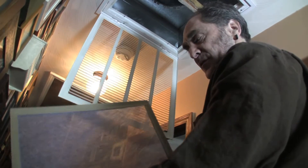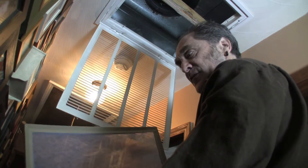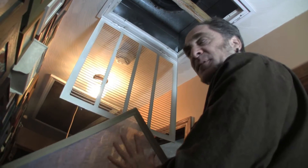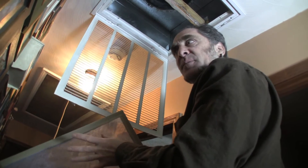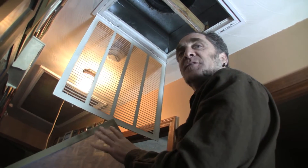Here's the filter. The bottom side would be very dirty if it were an old filter, but this one's barely been used — it was probably just changed. These are a great type of filter and very cheap, costing about 75 cents to a dollar. You really ought to change them about once a month if you're using your furnace regularly.